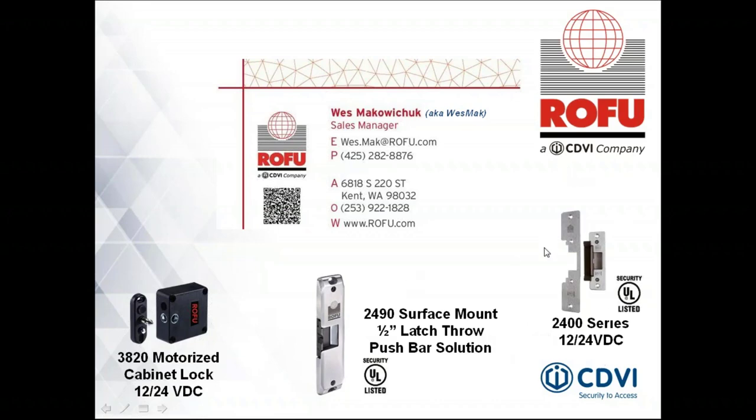The kits that I mentioned a bit earlier, the A22K kit, will include the kit DS. This is the door strike that you'll have in this, the 2400 series. But it's by far the most popular product that Rofu has available, and it is now available to us through us, as it's a new CDVI company. From what I was told, this one easily accommodates 75% of all the typical doors in a commercial or standard install. The two face plates make it very convenient for those types of installations.